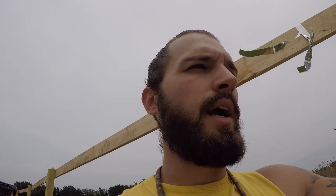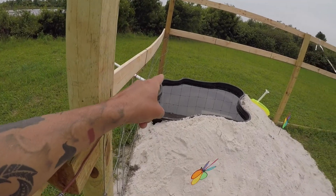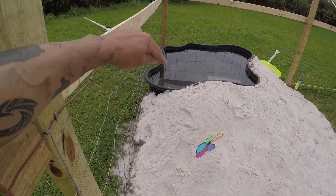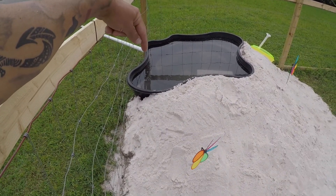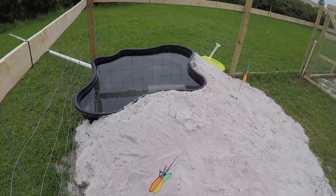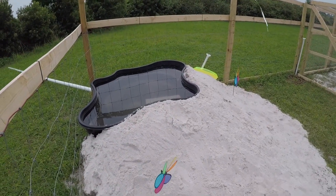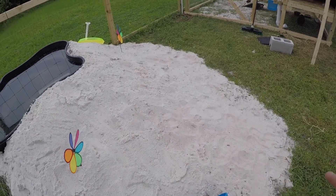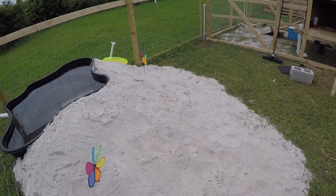So what we had to do was drain it and get some more cinder blocks. The ground is a tad unlevel right there, so we took a two-by-six and put it right where the drain pipe is, and then a two-by-four along the bottom. That helped level it out, so now it's pretty level. The ducks have been enjoying it — it's got a good enough grade where they can walk up and down it, and once the geese get old enough they can swim in it too.